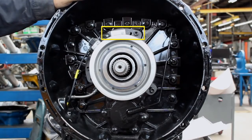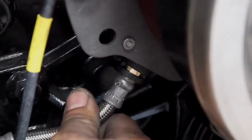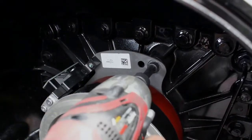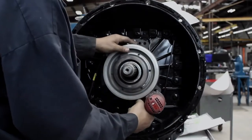Make sure that the input shaft has the discs facing upward. Next, remove the clip securing the air hose to the clutch cylinder, and disconnect it from the clutch cylinder. Remove the clutch cylinder mounting bolts, then the clutch cylinder.